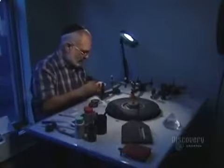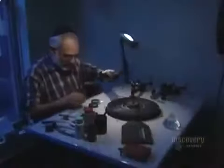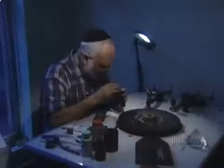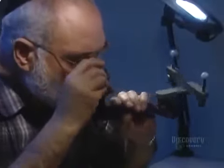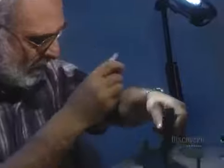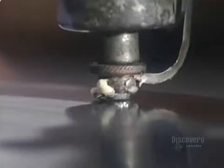The second stage of diamond cutting is called polishing. It's the process of forming the diamond. A special machine first tailors the basic shape. Then the diamond cutter puts glue in a mounting tool called a dop. This will hold the diamond firmly in place. He presses the diamond against a spinning cast iron wheel, coated with a mixture of diamond dust and oil. First, he removes any marks that were left by the saw.